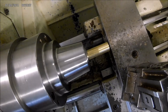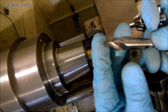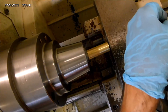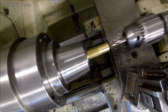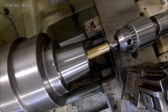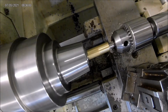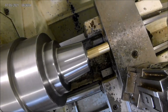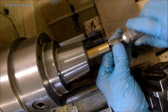We've got it drilled through. Now we're going to drill out the end of it — we're going to use a larger center drill and hollow out the end. I'm going to slow the feed way down here. That's the end done. Let's go ahead and chamfer the end here to get the sharp edges.